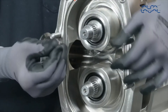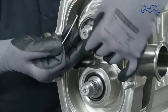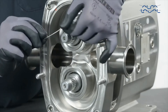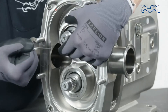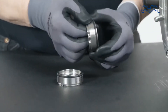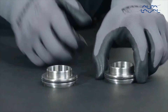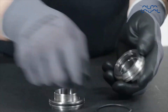Remove the primary O-ring using the tool included in the service kit. Remove the housing from the rotor case bore using the tool included in the service kit. Remove the static O-ring.